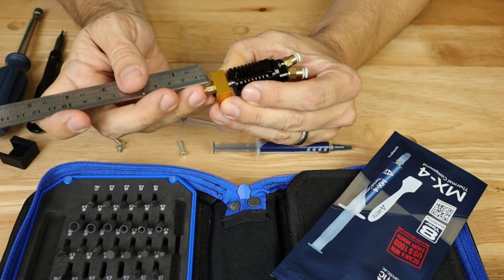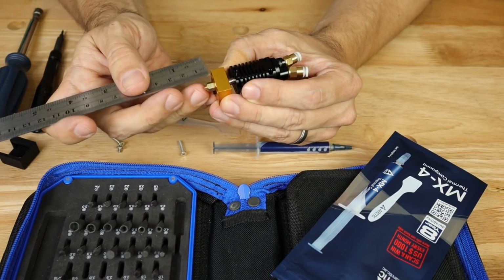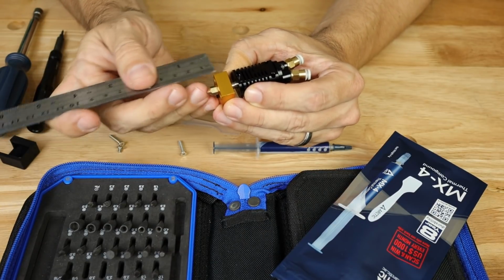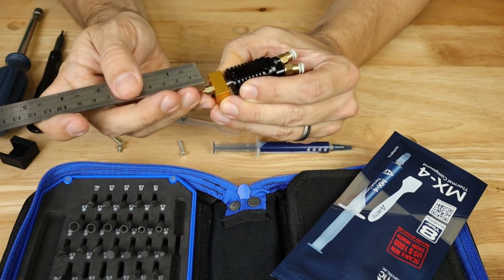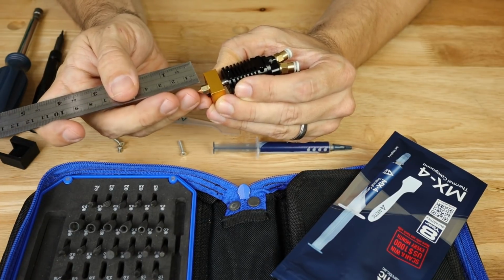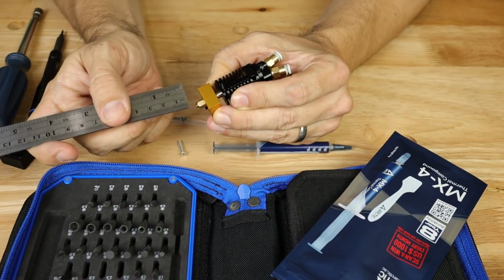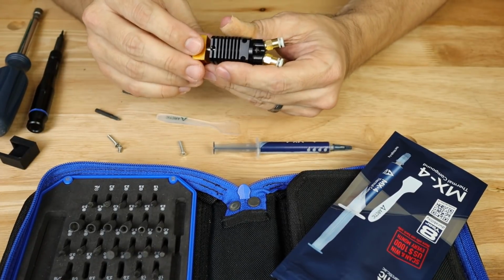We also may want to look at our nozzle, find out about how long we think we're going to have to purge. Again, the entire nozzle is probably about mid here. We're probably looking at about a 15 millimeter purge or so, at least to get that to where it starts getting cleaned out. But only experimentation will really tell us what the average purge that we're going to need is. So we can put this back together now.